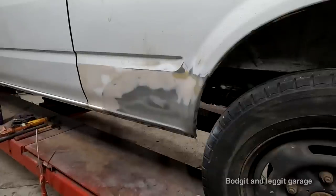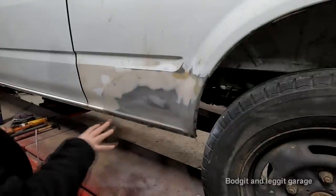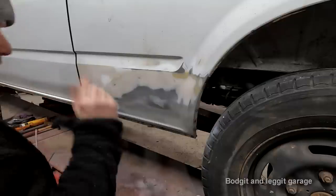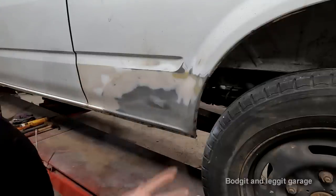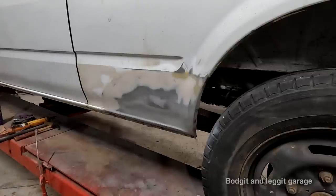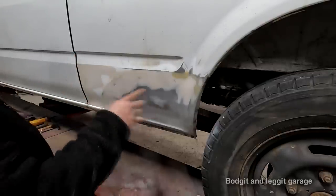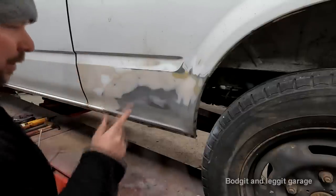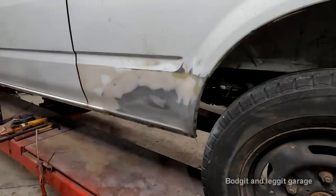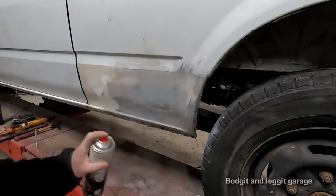Sorted. Most people won't show you putting paint onto a car, especially after they've done a load of bodywork, because it's the paint that shows all the imperfections. It can look absolutely perfect, but as soon as you put paint on it, the imperfections come up. I sprayed a vehicle on my channel, a black car with a huge dent in it. Go and check that out, because black is the worst. It has to be perfect. Etch primer first on all the bare metal.